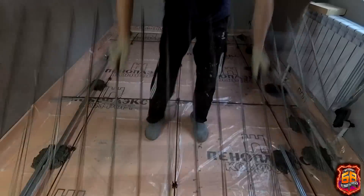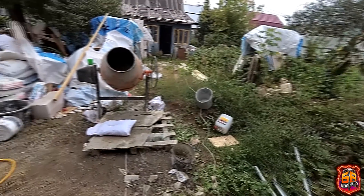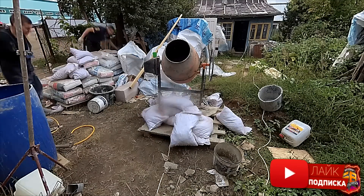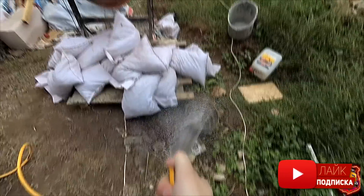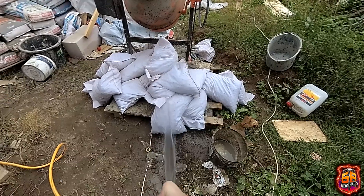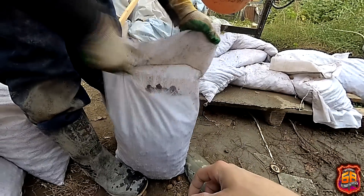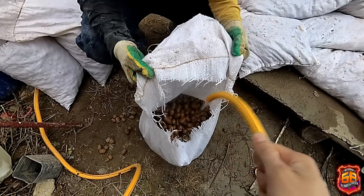There was one more room I can't stay silent about — my uncle's room. The screed there ranged from 3 to 6 cm. We decided to level it with keramzite, since all the gravel had run out by that point. We gathered all the keramzite into one pile and wetted it thoroughly, because dry keramzite will absorb moisture from the mortar. Pouring water on top of the bags didn't help, so we had to cut the bags open and pour water inside each one separately to ensure all the keramzite was fully saturated.